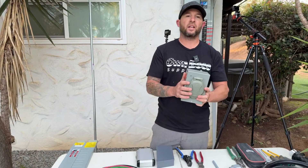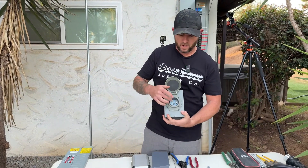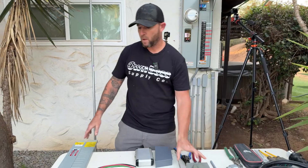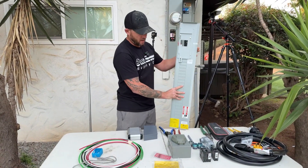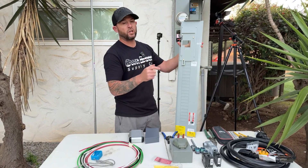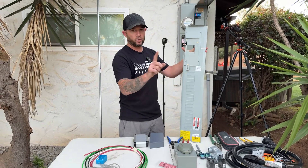Today we're going to be installing a generator kit into my house. Here I have my adapter box - this is going to allow me to plug into my generator. It's weather tight with a good connection for a 50 amp cord that we're going to be wiring in. We have some six gauge wire and a whole new panel face that we had made because they didn't make an interlock for my panel. I'll put all the information in the description.